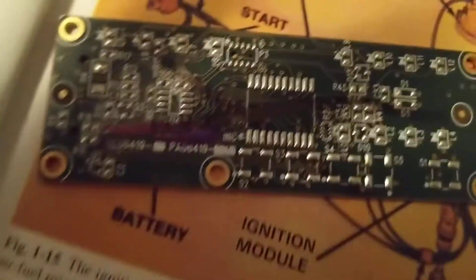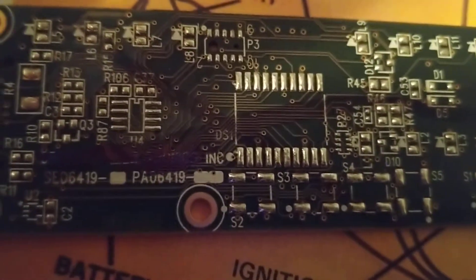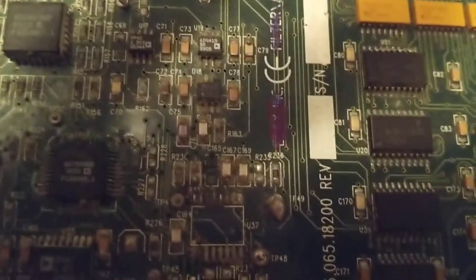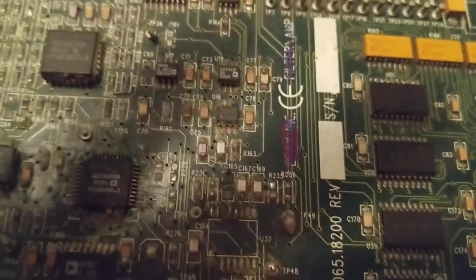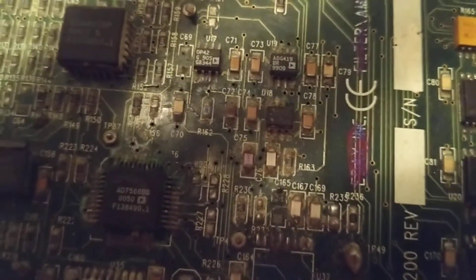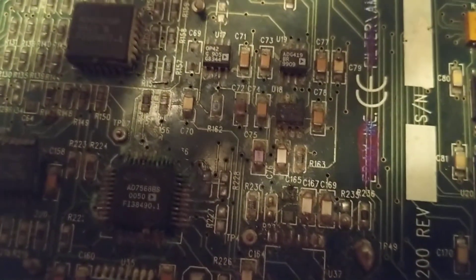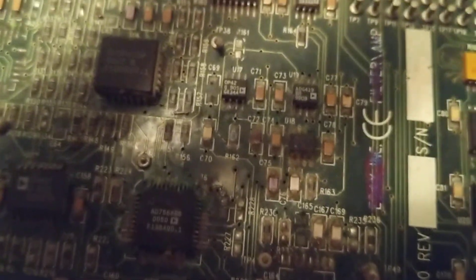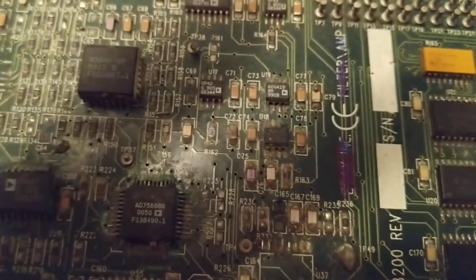This is what's going on in these boards — these small resistors and capacitors come off. They make them even smaller, so they come off and don't make a connection. You have to put pressure on the board to see if any open up. This is technology, and this is from experience. You will not see this explained on any other channel or automotive technician channel — I guarantee you. If you want me to show you how to change these with leaded or unleaded solder, no problem. Please subscribe to my channel — Automotive Electronic Schematics by Joseph — and if you found it interesting, please give a like or comment. I always answer the comments. Thank you.